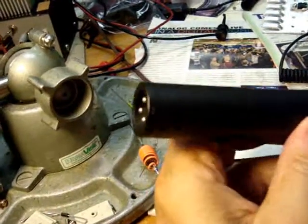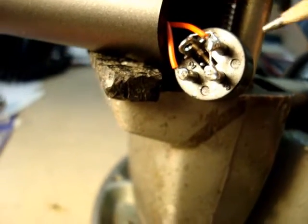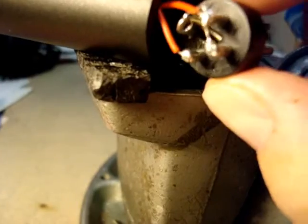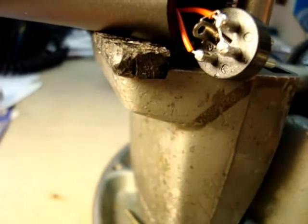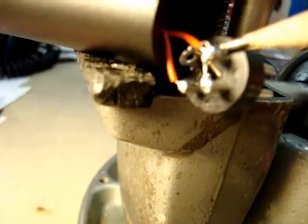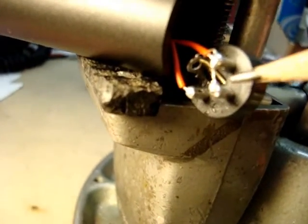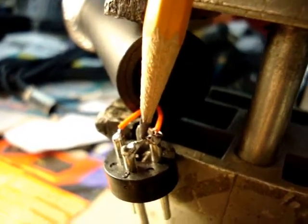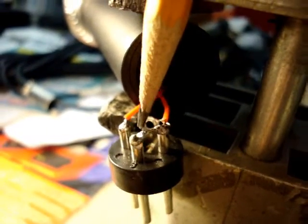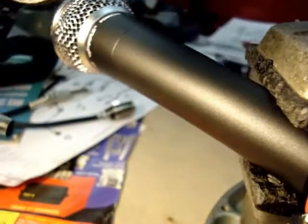Let's look at the microphone, take it apart, and look at the connection inside. Again, with Pyle microphones — as was with the Pyle 57 knockoff — they've connected pin one and pin three right there. See that? This red wire here needs to come over to pin three, and you break that connection right there. That will make this microphone a balanced mic.